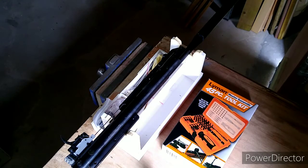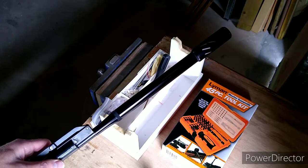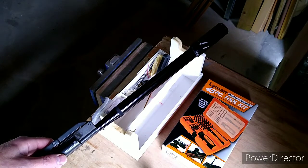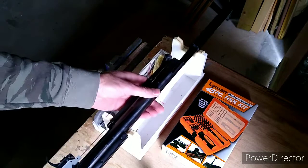As I mentioned in the last video, I'm going to be replacing the trigger and the spring on this Lightning. Normally I wouldn't bother taking the barrel off because I don't really see the need to — I've got clamps long enough — but this one has a moderator on the end. If I unscrew that, it's not exactly the strongest, so we're going to have to take the barrel off.